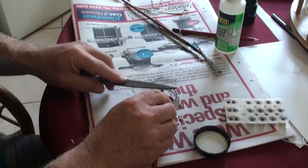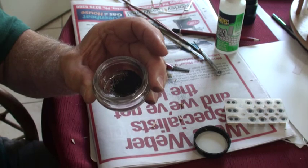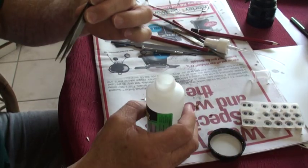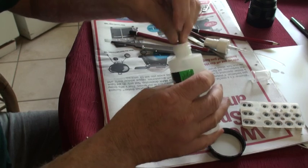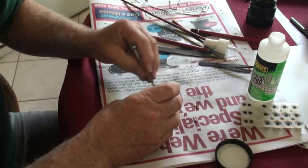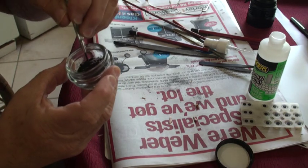Be very careful because this graphite from the lead pencil is very, very pervasive — it will mess everything up. Now we've got a good quantity of shavings in there. We want to transfer a small amount of isopropyl alcohol into the filings. I'm using a little pair of tweezers — I'll close them up, bring it out, and just bring a couple of drops at a time in there. Now we'll mix it together into a slurry. Don't want it to get too wet. This looks like it's just about the right amount — once I've mixed it in, it should be pretty good.